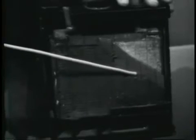A car battery is another example of developing the voltage by chemical means. In this case, the electrolyte is sulfuric acid diluted with water. The electrodes are sponge lead here and lead dioxide here with a separator in between. Basically, this battery develops the voltage in the same manner as the dry cell.